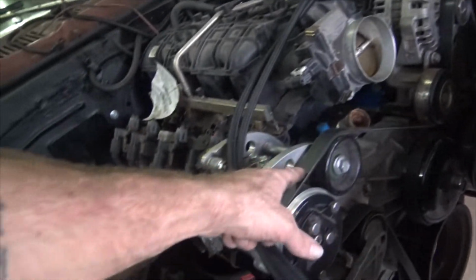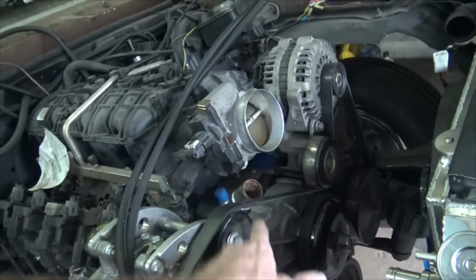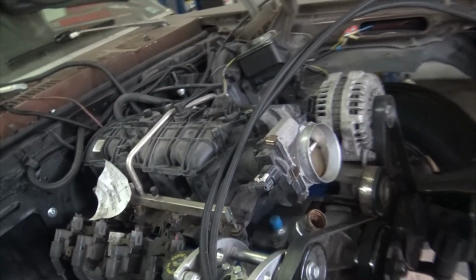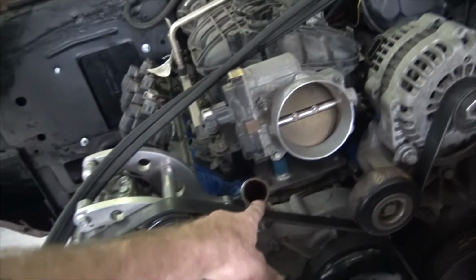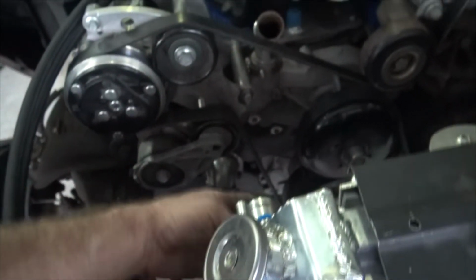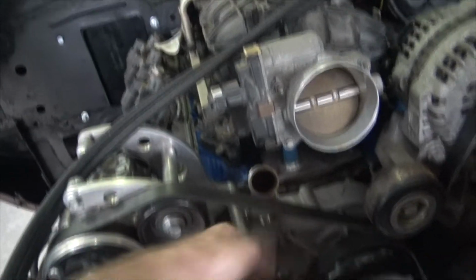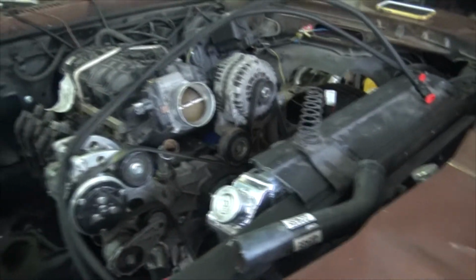So now moving the radiator over here and then realizing that I had this wrong. So originally I had this guy tucked up underneath here and going under there, which seemed to work, but it was burning up my belts. It was kind of beating them up. So now, I mean, it's obvious. So I got to go to here and over to here, but obviously that's in the way. So I don't know. But yeah, our fan shroud is on. Our radiator is in.